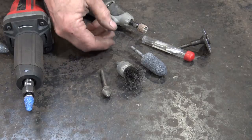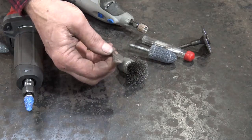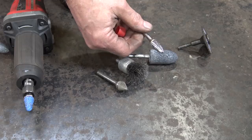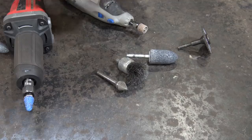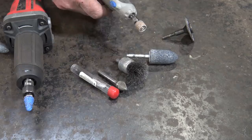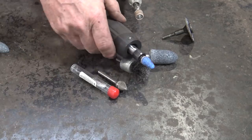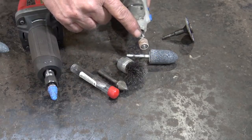What makes rotary tools so good is the variety of grinding stones, wire brushes, steel burrs or cutters — and some of them are very high dollar, very nice cutters that will cut annealed tool steel. I can use these for shaping the inside of an axe eye and lots of other things. You can get little cut-off wheels for doing precision trimming, and similar bits, burrs, and discs that fit smaller shaft rotary tools. The big die grinder is a quarter-inch shank and the smaller one like a Dremel tool is an eighth-inch shank.